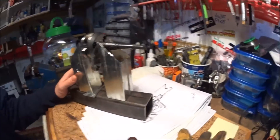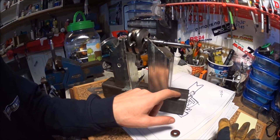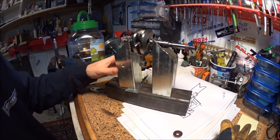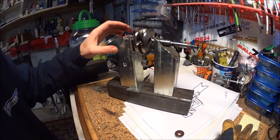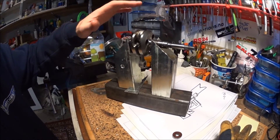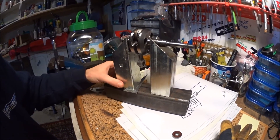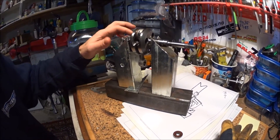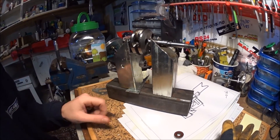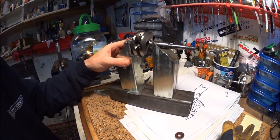To make this as level as possible, I'll weld one side first, then mount the dial indicator and dial in the shimming while moving the crank sideways. When it's perfectly flat or level, I'll weld it — it will move, and I'll have to use a file to fine tune it of course. So I'll weld that piece in and start dialing in this piece.